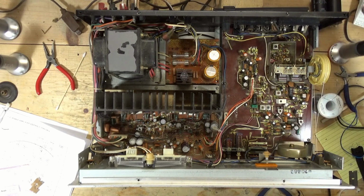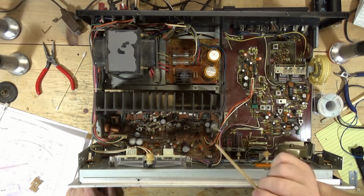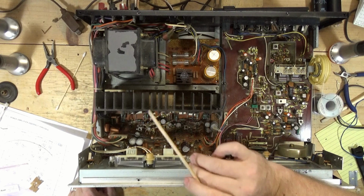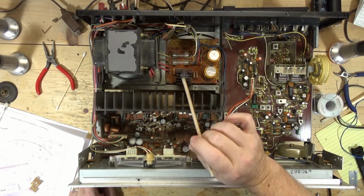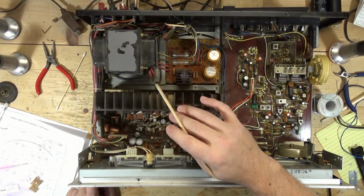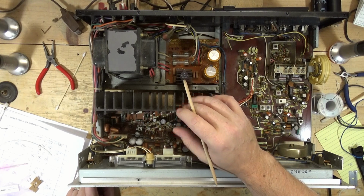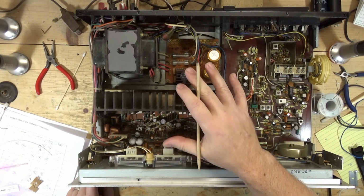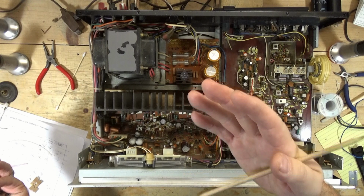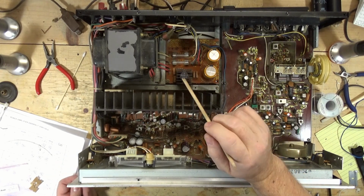I was at my wit's end with this, and I had tested everything on the board. Here's the tricky thing. I pulled it, I tested it. When I put it on my Atlas component tester, it would show that it was good, and then it would show that it was an LED diode junction. But the legs looked a little sketchy, so I thought maybe it was an issue with my probe contacts. But the light bulb didn't come on in my head to say, hey, if it's doing this on the tester, it's probably doing it in the circuit as well.